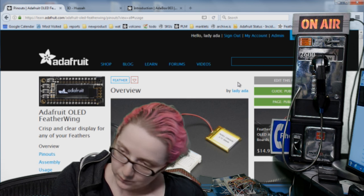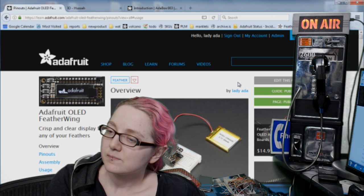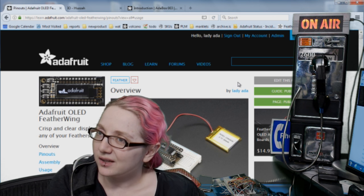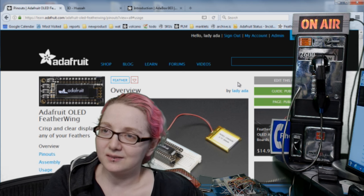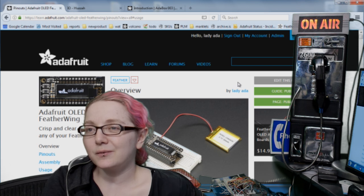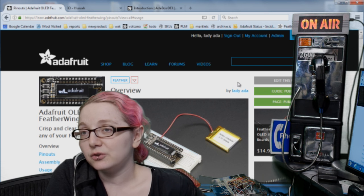Can we harass you? No. Okay. Can you integrate a Fona and the microcontroller on one chip? We have a Feather Fona. It's a little bit of a challenge. There are a lot of power requirements, and the Fona is doing cellular. It's very noisy, so I would recommend maybe having the Fona a little bit farther away, if possible. But yes, you can integrate them.